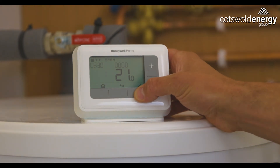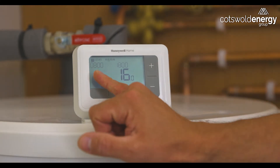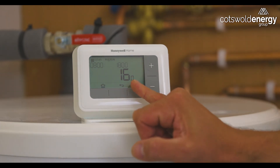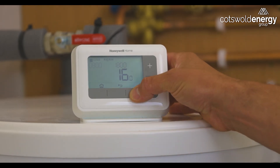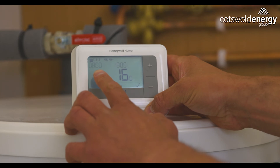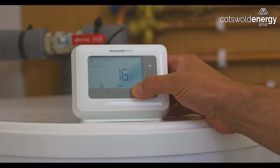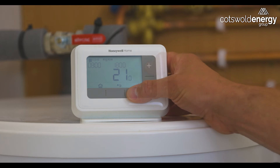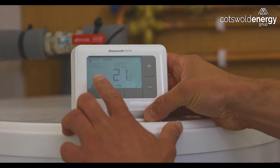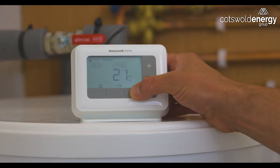If we accept that and press tick and go to P2, we can see that at 8 o'clock in the morning the desired temperature drops down to 16 degrees until 6 o'clock in the evening. If we want to change any of these settings, press tick again until any one of the values is flashing, then press up or down to make changes. So if we wanted to, we could raise this up to 21 degrees, and the system would then be maintained at 21 degrees between 8 in the morning and 6 o'clock in the evening. This method applies to all four program modes.